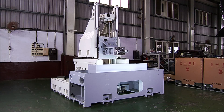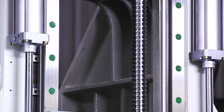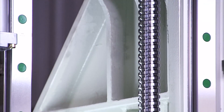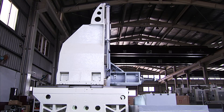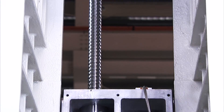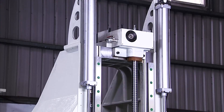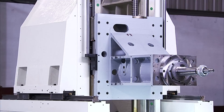All of the FMG series machines share a common three-axis travelling column design which incorporates a unique high waist column support to significantly increase rigidity. The travelling column design features high quality heavy duty linear guideways, a Tsubaki class II 50mm diameter ball screw, and even a pneumatic counterweight balance for smooth movement and excellent positional accuracy.